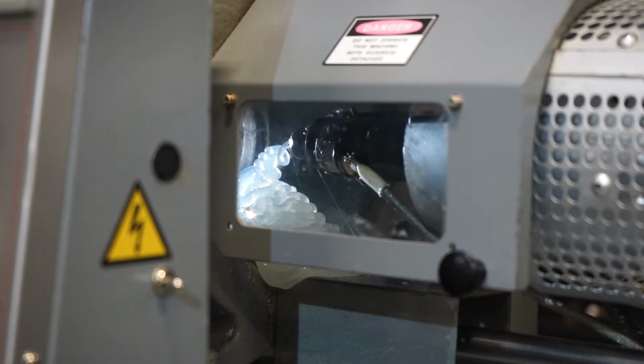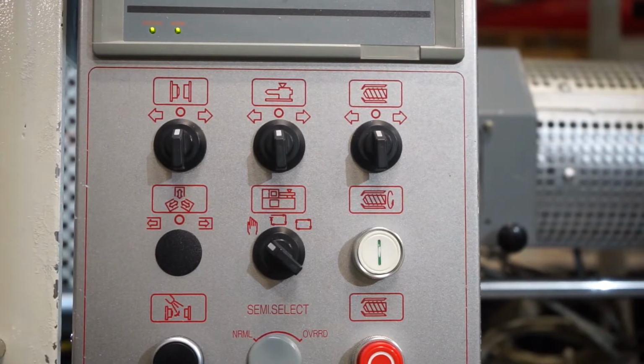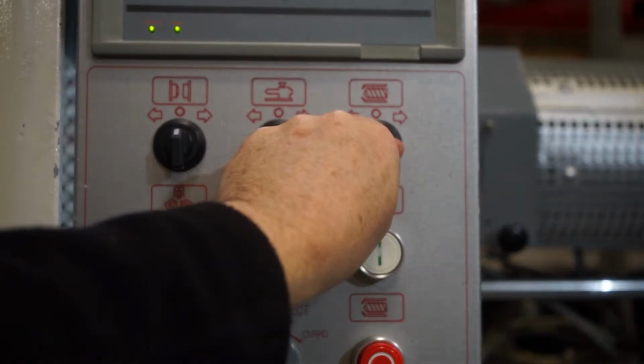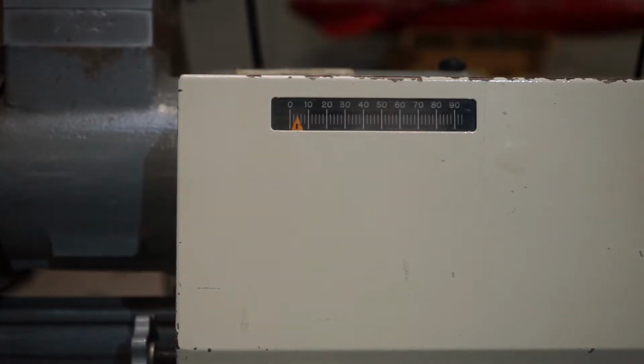So there we go, we got all the plastic out. The next step will be to inject it one last time manually to the screw bottom. Let's put the screw manually down on screw bottom, so inject it all the way forward. Now we're going to manually retract the screw, or suck back, to the full back position. And this will pull any remaining plastic, most of it, out of the threads of the nozzle body and out of the tip. So you can look at the screw indicator there and see that happen.